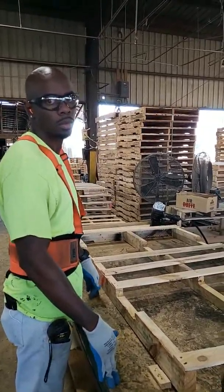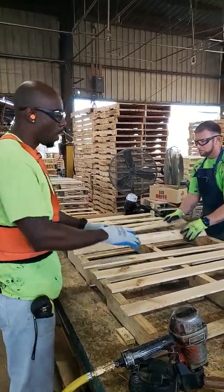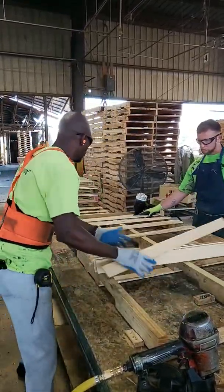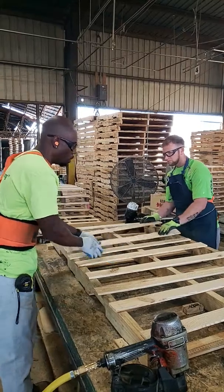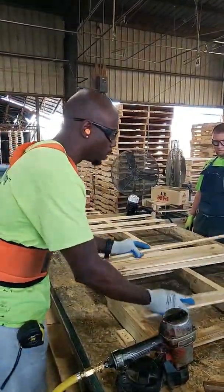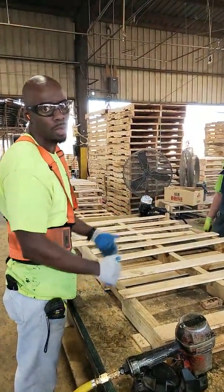Now we're going to flip the bottom and build the top. The right way to spread the board is to spread it out like this — you never want to just lay the boards down in a pile and grab one and shoot. You want to spread it out so you can see what you've got and make sure all the boards are spaced and lined up evenly. If you just stack them, some boards may end up spaced too wide and the pallet looks wrong. Also, when both partners spread it out together, it's faster and more effective. You also want to make sure the rough side is always facing up.